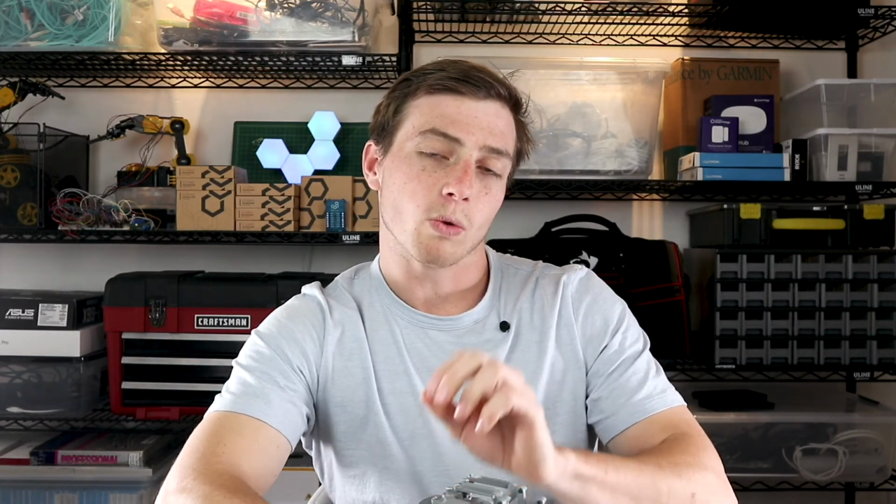All right, now that the firmware upload is complete for the Exo Hand, we can go ahead and figure out the ranges for each potentiometer. We use 10K potentiometers, but because of the way in which the Youbionic hand articulates, we only get a small subset of that range. So we need to figure out that range so that we can use it in our application to determine when the finger has been extended and when it's retracted.